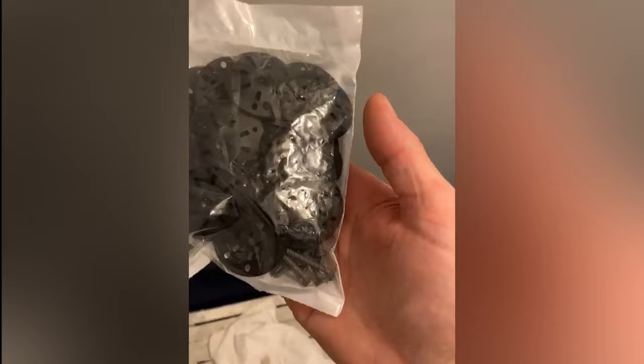Okay. All right, last step is I've got this accessory pack with the plastic plaster washers and the screws, and I am going to go through and put one of these in as many of the holes as I really need now that the adhesive's in there to hold everything tight. And we'll come back tomorrow and pull these off and it should be back to normal. Then we just have to patch that hole. Next project.